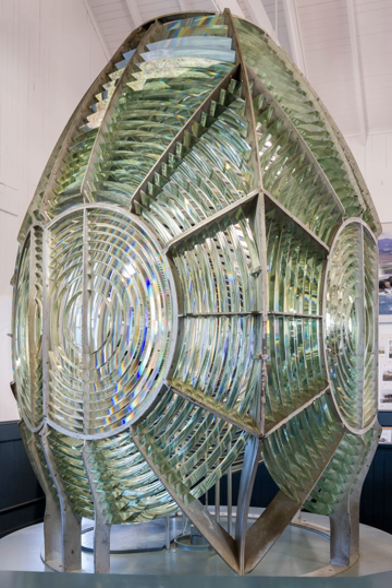In some lenses, the curved surfaces are replaced with flat surfaces, with a different angle in each section. Such a lens can be regarded as an array of prisms arranged in a circular fashion, with steeper prisms on the edges and a flat or slightly convex center. In the first and largest Fresnel lenses, each section was actually a separate prism.